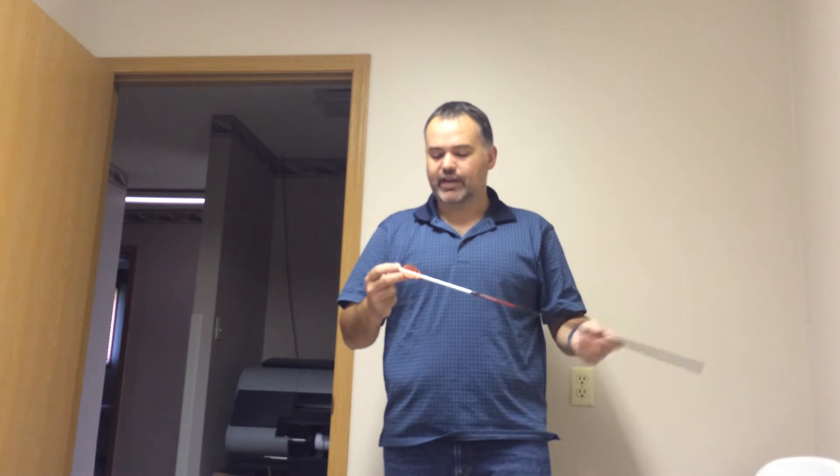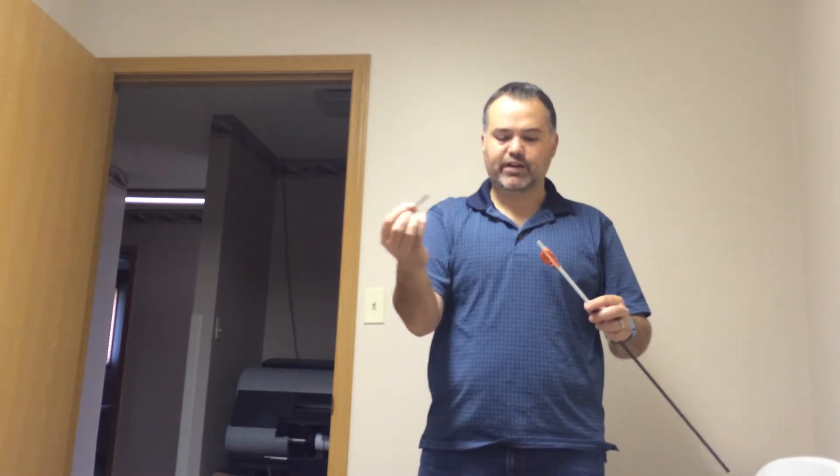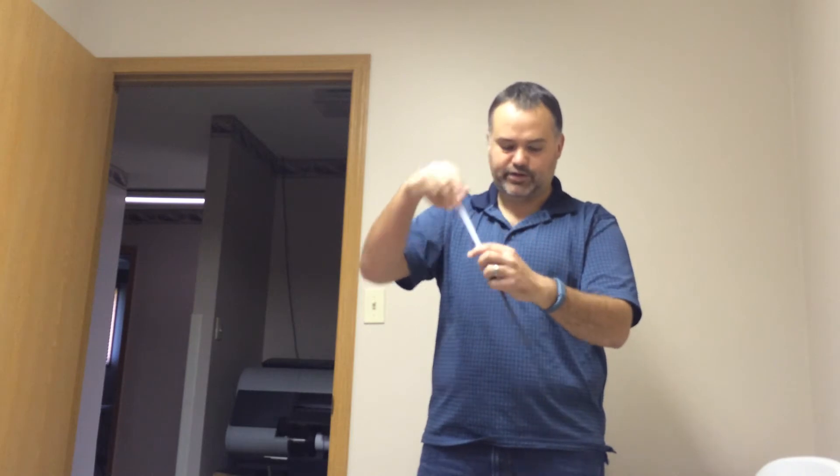The safe, easy way to do it is to use a drill bit. I pulled the knock out of the back end of this, I take a drill bit — I've already found the one that fits it good — a drill bit that fits inside that arrow. I flip it around backwards just like that, and I'll use the heavy part of the bit to drive that point out.